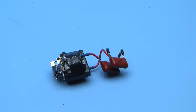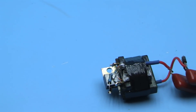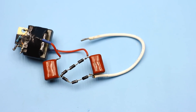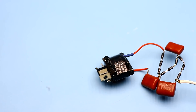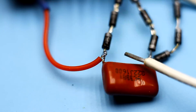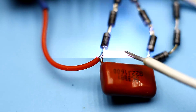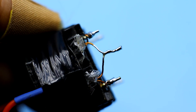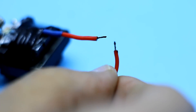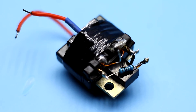It remains only to install the whole device in a suitable case. The part with the high-voltage transformer is very advisable to pour with epoxy, or paraffin in the absence of resin. How dangerous is this device and can it defend you? Alas, for self-defense this option isn't the best because of the too-low output power. In addition, the air breakdown distance is small — if the attacker has thick clothes, such a shocker is useless. But it does bite rather painfully. Links to all components and ready-made modules can be found in the description. Please rate this video and if you have any questions, you can ask them in our group — the link is also in the description.